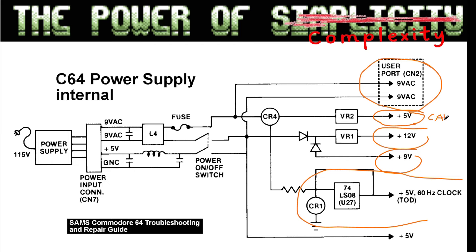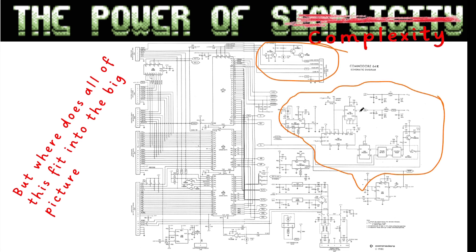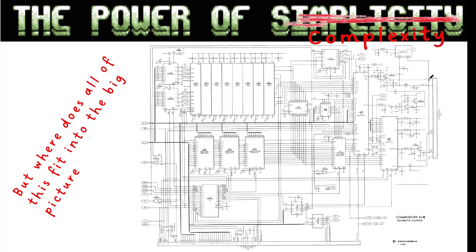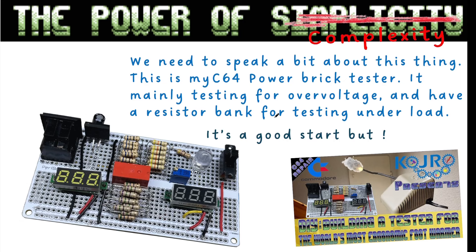To see things in the big picture: up here you have the tape drive, here the big oscillator circuit — before this was put inside the 8701 chip — and here the power diode and 12 volt and 5 volt regulation, and the time of day circuit to make logic level output. On this schematic you can also see the oscillator for the video signal and the clock circuit for the video dot clock and CPU frequencies.